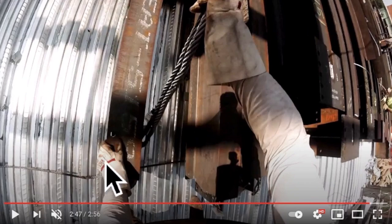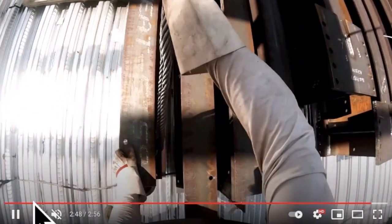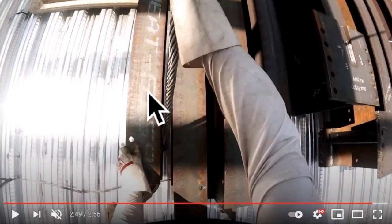That's really bad. New connectors always put their hands in bad spots when shaking out. A good rule of thumb is to put your whole hand up here in this area, because you can't get your hand pinched with the hook. A lot of good iron workers have pinched their hand with that. I've been lucky that I haven't, but a lot of good connectors, some way better than me, have. So put your hand up a little bit away from the hook over here on the flange, not down here at the end of the flange where this hook can just bite you in all sorts of spots.